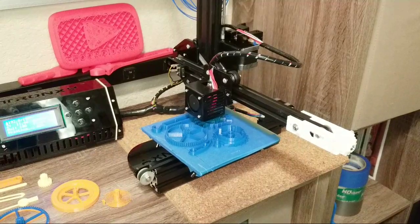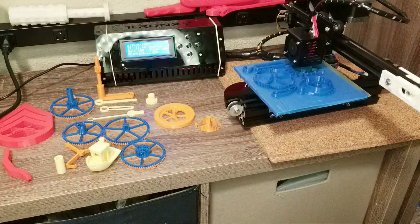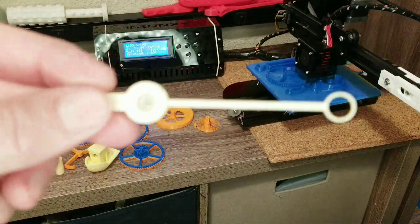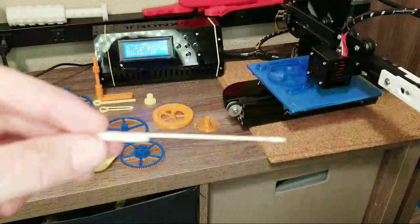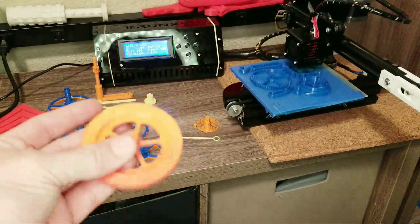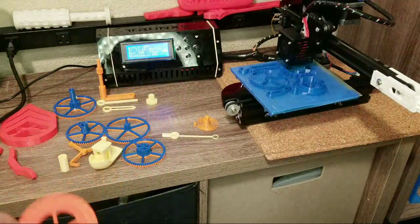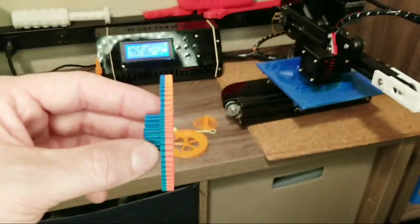The clock is actually really coming along. There's about 40 pieces, and this thing only has a 150mm print bed, so I'm splitting it up. I started off with these — these are the arms. They look really good. I switched to orange for the second plate. This is the second batch — underextruded. So I changed some settings in the G-Code for this batch. I'm really impressed with how good the parts look.